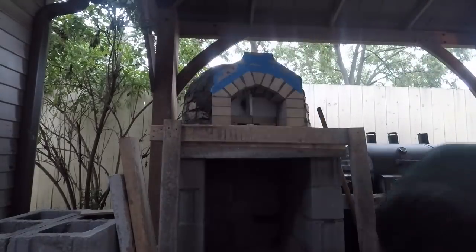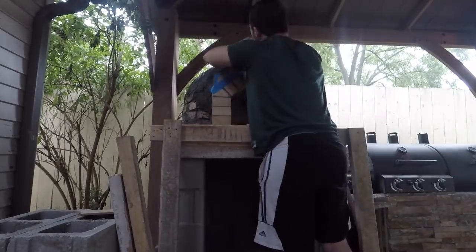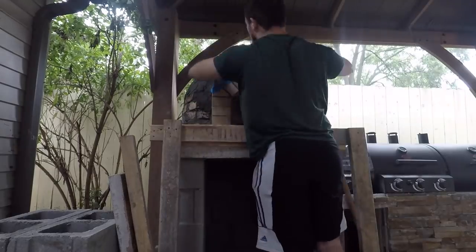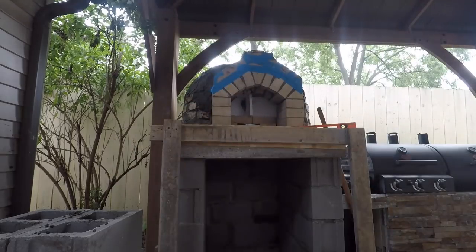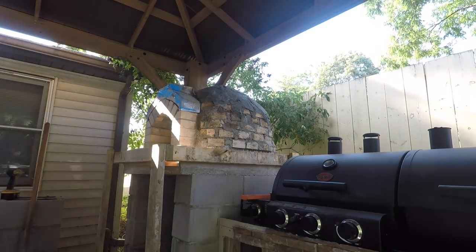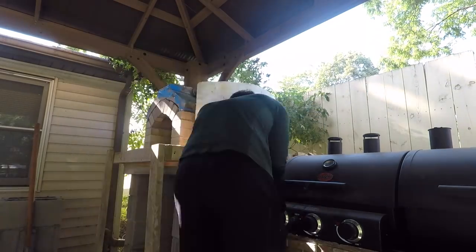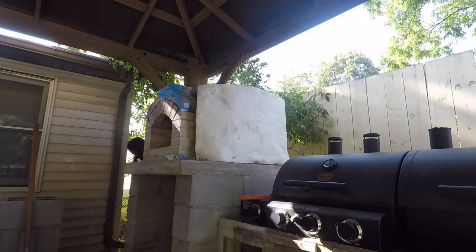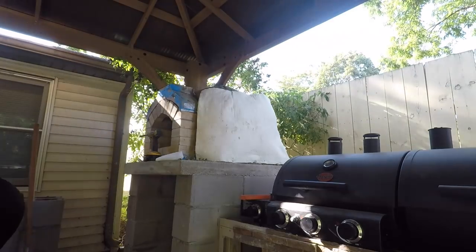So that chimney frame you guys saw me make, I'm filling it in right now with a refractory cement, perlite, and sand mixture. So I'm just filling it in nicely. And later, you'll see that I use a 6-inch stainless steel. The top of it right now is a 6-inch stainless steel. I forget what those are called, but. So right here, I'm putting in, I think it's either 1.5 inch or 2-inch insulation blanket. This is ceramic fiber insulation blanket. Yet again, this is good to like 1400 degrees Celsius, so.